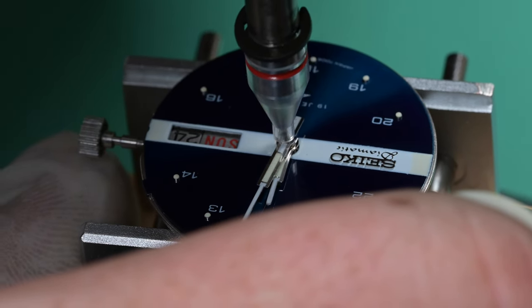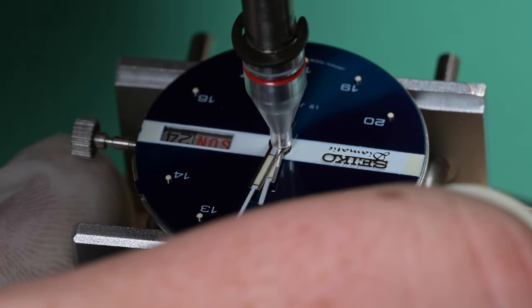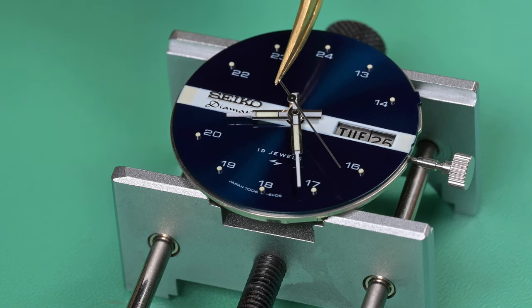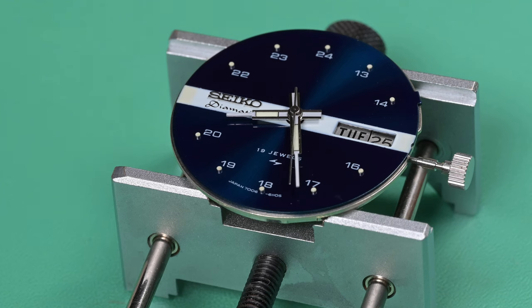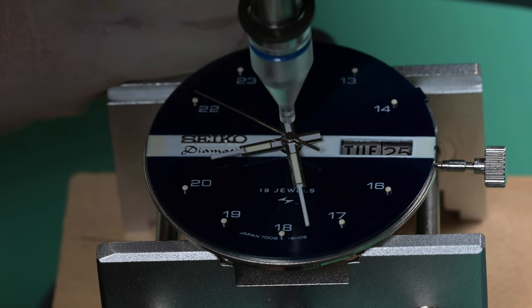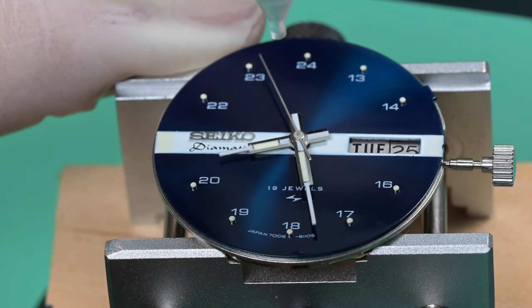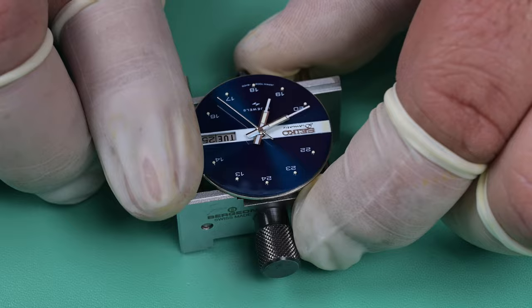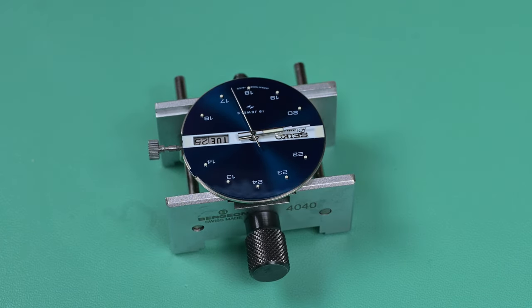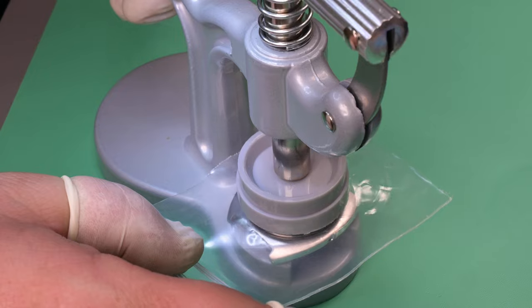I install the arrow hand and I'm installing the minute hand with my recently acquired and ridiculously overpriced hand-setting tool. I get why people like them — I've had the less expensive ones and the hand pushers and I still have them, but I'm really glad I was able to get that tool. Once we have those hands in, I take a look at them up close on a profile view on the microscope — no footage because I didn't hit record — making sure that the hands are parallel, not hitting each other or hitting the movement or the dial.